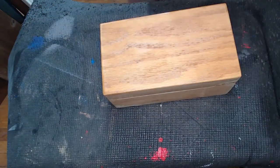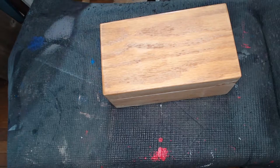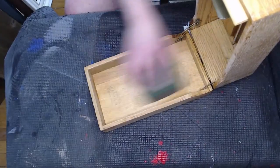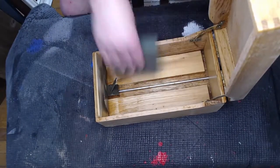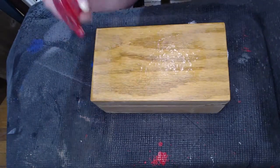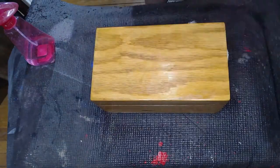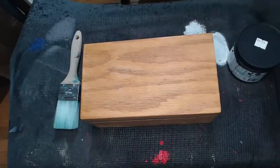Here you can see me going through — I've already cleaned the piece and I'm just doing a light scuff sanding, and then I come back and clean that off very thoroughly. The most important thing you need to do in terms of making paint stick — making anything stick — is to make sure that your piece is incredibly clean from the get-go. I know it's not fun, but it is really important, and that's why I like to stress prep in all of my videos.